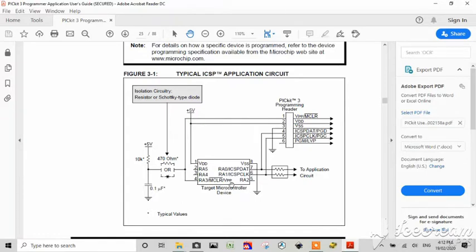and this is a microcontroller device. So this is our PIC, and you can see it's on pin 4. And then typically they want you to put an isolation circuit in to give it its separate power supply, but I'm worried about this. I'm not doing that. So what I've done instead is I've done an isolation resistor between pins 1 and 4. And so I've adopted this, right, and we've actually got these outputs here.